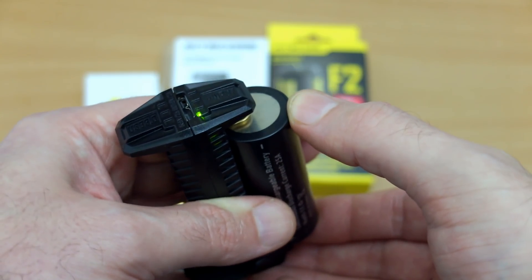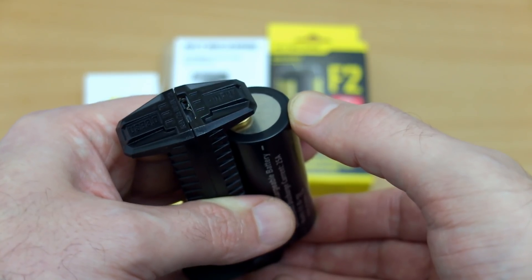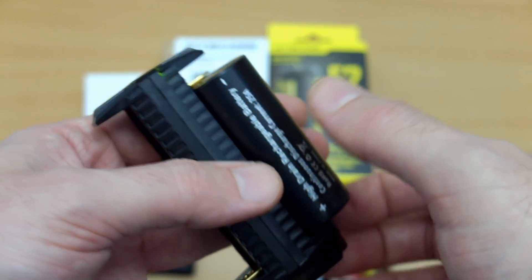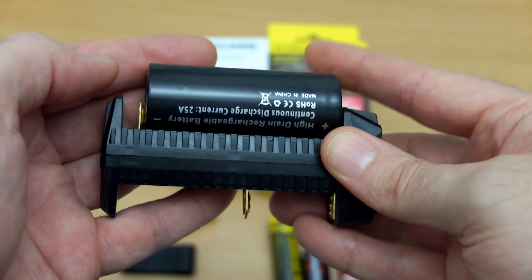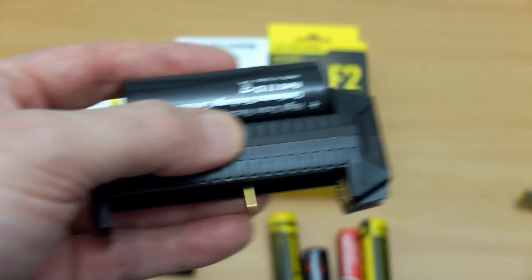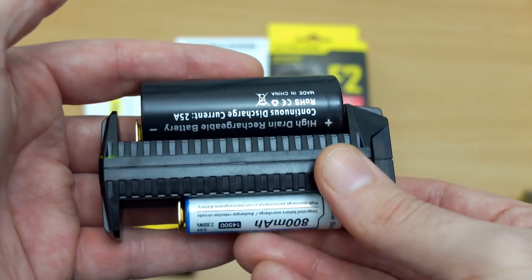You have one LED indicator for each channel. The first digit flashes to give you the voltage, and then the second digit — so you get three flashes for 3 volts, five flashes for 3.5 volts. It tends to round down, so if you're at 4.15 volts it will flash 4.1. But it's good enough to test batteries and get a good idea of their voltage without using a separate battery tester.